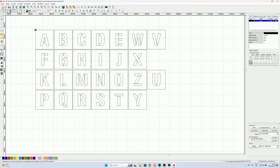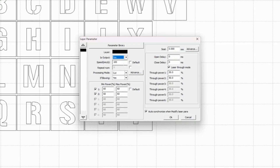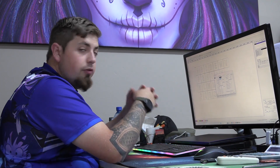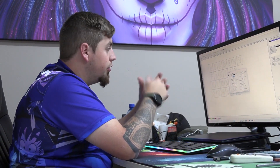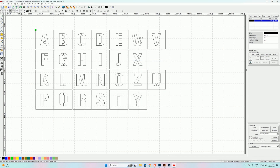Let's have a look at our settings. Because we're cutting this out of ABS, I want to make sure we don't cut too slowly — when cutting ABS, the slower it goes the more likely the material, once cut through, is still very hot and ends up melting back to itself. You also don't want to cut it too fast. So I'm going with 100 millimeters per second and 60 percent power. Some people might think 60 percent isn't enough, but I've got a 150-watt tube, so 60 is more than enough at that speed cutting through only 1mm ABS. Settings are set — we'll save it to a memory stick and head to the laser.